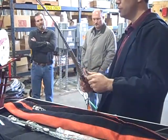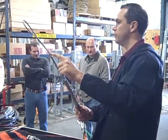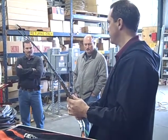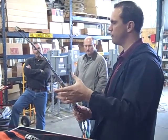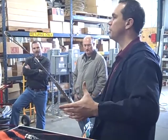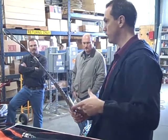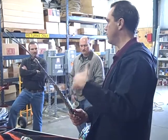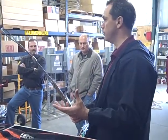Now, you would normally take this all the way up to about an inch from this main crimp. Okay, so this is a single basket per conductor. The benefit there, as opposed to a single basket for all, is that when you use a single basket for all conductors, you're only getting 25 to 30% surface area tension, and you're hoping that the compression is going to work, okay? There's a lot of other ways that that's supplemented, whether it's drilling through conductors, putting tie wire in, the application of tie wire and tape, et cetera, which ends up creating a lot of drag on the head of your pull as well.